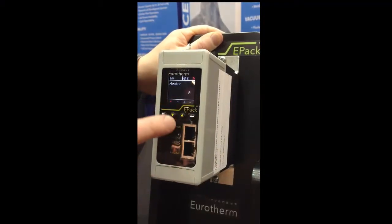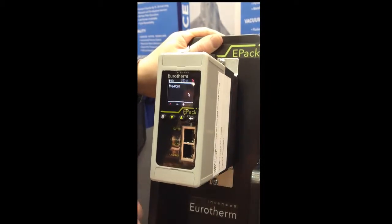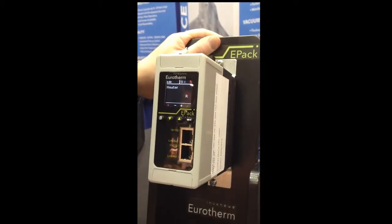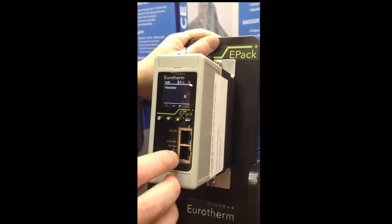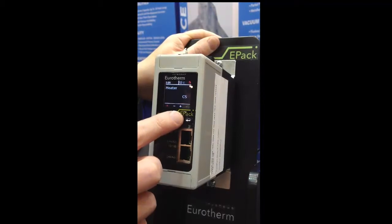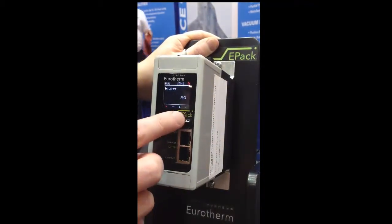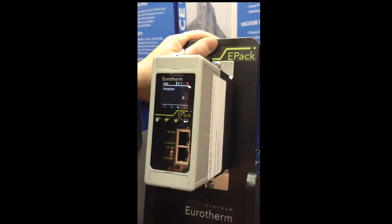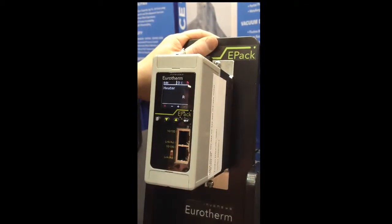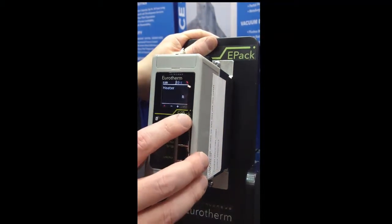In this case, I also have the ability to select the kind of load that I want. That would adjust or tweak the configurations in order to always get the best result. So I can have shortwave infrared, silicon carbide, molybdenum heater, or just a regular heater, like any kind of alloy type of heater.